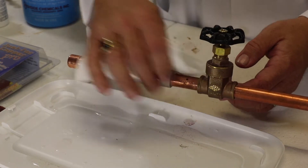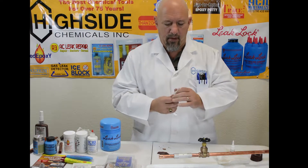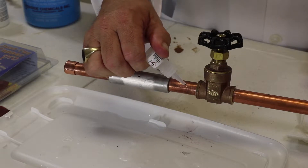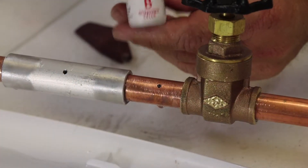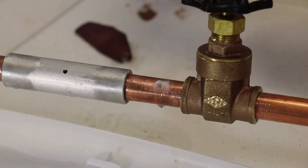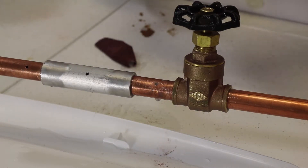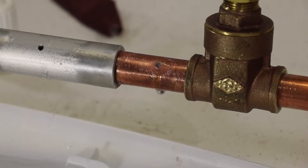I'm going to dry that off one more time because there's still water in these pipes. So we're going to use HVAC Instant Patch. You start with Part A — the bonding liquid — and put it over the top. Then go back with Part B, the bonding cells. The bonding cells have an affinity for the bonding fluid, and you can see it stays right there. You can apply liberally. Then go back with Part A as your third step — put the bonding fluid back over the top. In just about 20 seconds, you'll have a 700 PSI bond, good to 250 degrees.